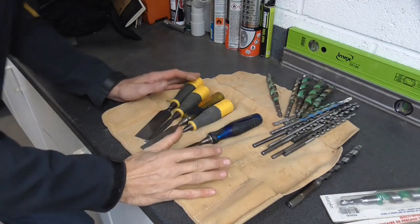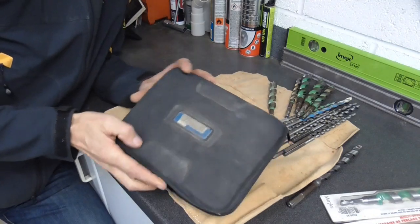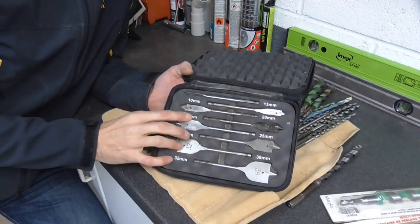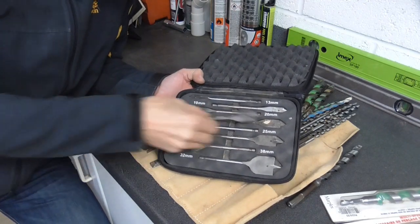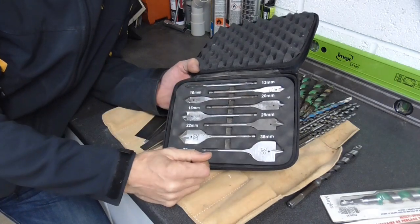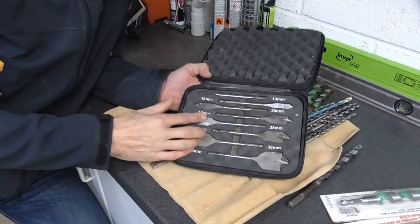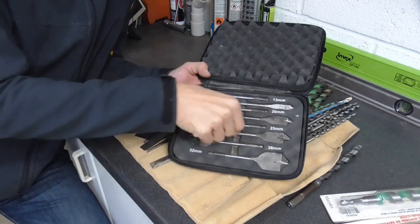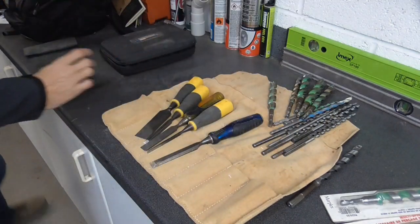Just for full disclosure, I'll show you another kit I've got. I know people have mentioned I use auger bits and a lot of people use flat bits. I've got this set — it's not particularly trade-rated but I keep it and find it useful. It's nice to have a set with every size. I don't use them very often but there might be a size I haven't got in auger bits, like 38 mil for fitting a cylinder night latch in a security door. I'm not a particular fan of spade bits — self-feeding ones can wander a little bit depending on the material.